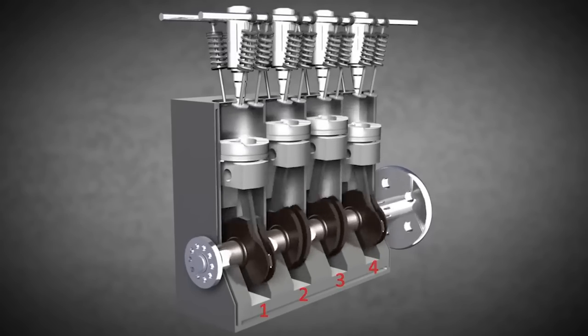Because if you do start the engine — and you really might if you crank it a little — with all the pistons, camshafts, valves, springs, and everything in this motor, it's bone dry. There's no oil, no lubricant. You have somebody in a boatyard slam it with a battery, the engine runs — great. Meanwhile, you've knocked maybe 5,000 hours off the engine because all that metal is tearing against each other. The old rule was three years — if an engine's been sitting for three years or longer, this process needs to be done.